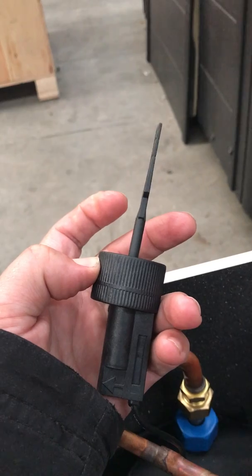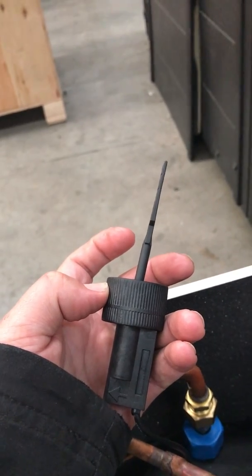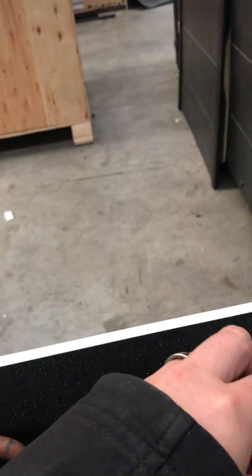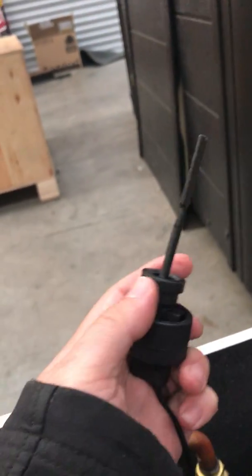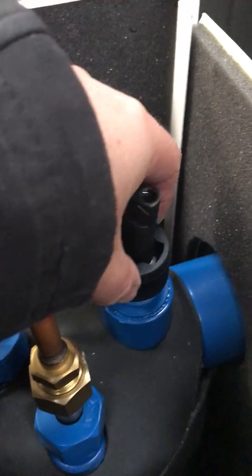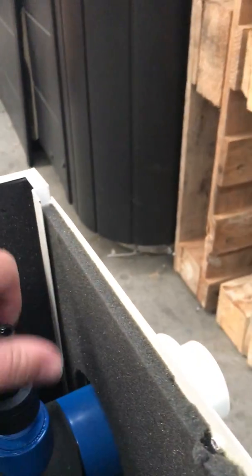If it doesn't, if the error doesn't come up, and you release it, the error should come up within 10 to 15 seconds apparently. That would suggest that the water flow isn't enough to push it. So it could be that it's oriented in the wrong direction, or it could just be another flow issue. So if it doesn't fail when you're holding it and then it does fail when you release it, the switch is in working order. If we can just try that switch back in both ways, so don't forget to redo the valves and everything.